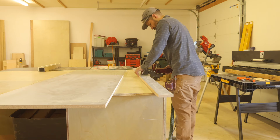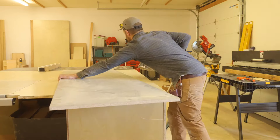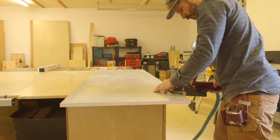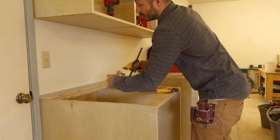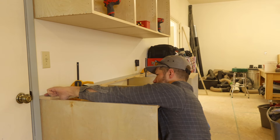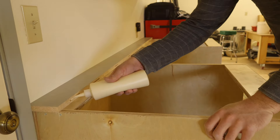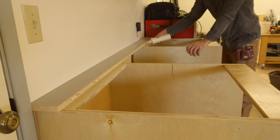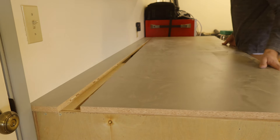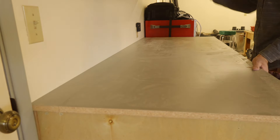Just using some regular biscuits to attach these pieces. I love that biscuit joiner - it's just a regular classic LaMello. I only glued in the biscuits; I wasn't really looking for a super strong glue joint. I figured I'd throw some glue in the biscuit slots, pop this thing together, and then screw the other piece down. The joint came out pretty good - good enough for what this is. I did put a little eighth inch round over on the edge of that melamine. I might put a piece of nosing on it eventually, but probably not if I'm being honest.